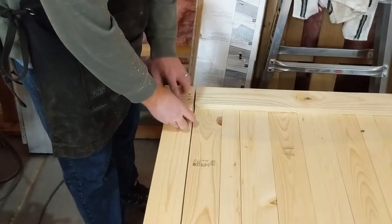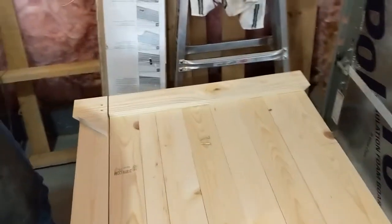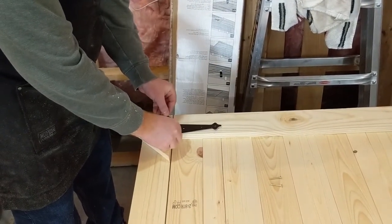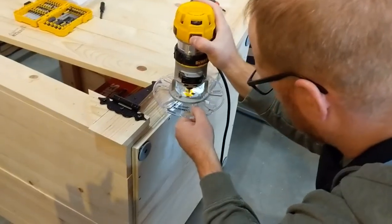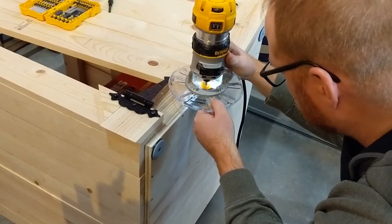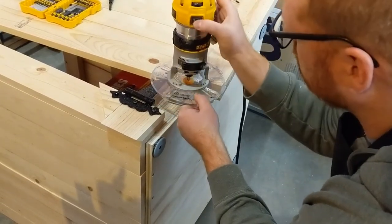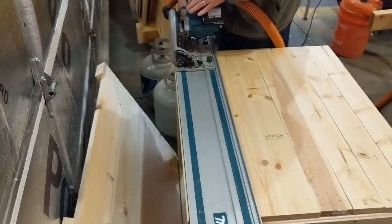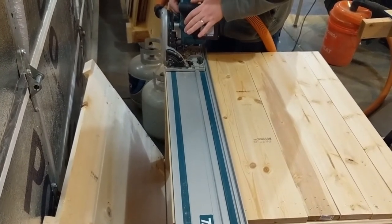We had to cut a couple of triangle pieces to make our hinges work on the front door. We picked out these decorative hinges and they're a little bit too big for our current trim, but as you can see with the triangle they fit quite well on there. We did use a trim router to chamfer off a little bit of the door just so that the swinging motion wouldn't get bound up in the hinge. Once we had our front door on, we had to trim our sides down a little bit just to make sure everything was nice and square.